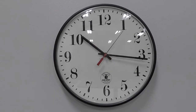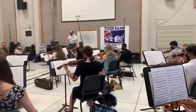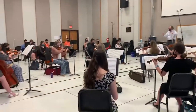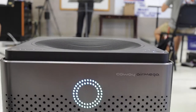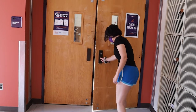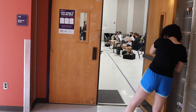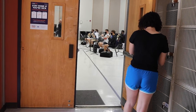This is designed to limit the amount of aerosol that can accumulate. After 30 minutes indoors, the room should be cleared for a minimum of one air change before resuming rehearsal again. The use of a standalone HEPA air cleaner can enhance the air change rate. When possible, rehearsals should be held outdoors, but doors can be opened or windows cracked to increase ventilation in the indoor rehearsal space.